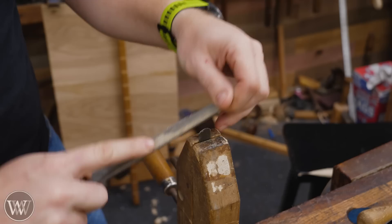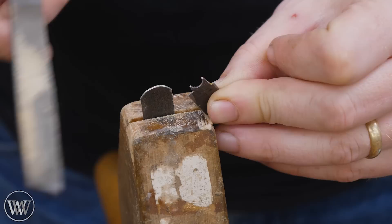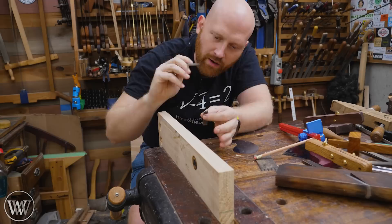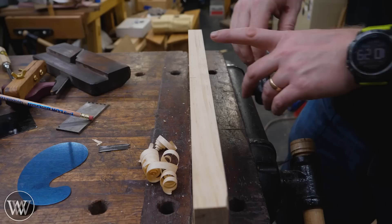When I get it close to the shape I want, I'll grab a really fine file and just refine it down to the end shape. This one is basically just a smooth round to cut in a little ways. If you want to make a beading tool, you can use a rat tail file and cut down until you get to the depth you want, then come in with a couple mill files and shape down the teeth on either side and you've got yourself a cutter. The nice thing is when they get dull, they're really easy to sharpen — you don't need a burnisher like a card scraper. For a scratch stock cutter, all you need is the same file you used to create it; just cut it a little bit deeper, just one more step, just a couple shavings. That forces a burr out on both sides and you have a cutter that's ready to go again. Every time you need to freshen up, just cut it a little bit deeper — kind of like a saw.